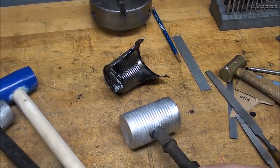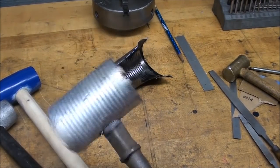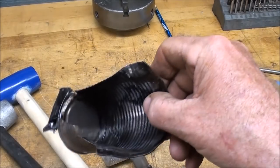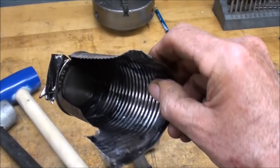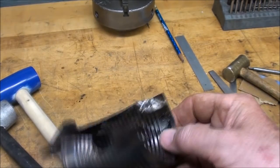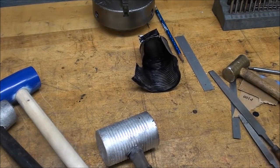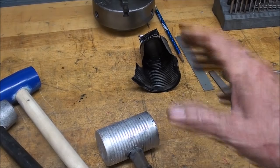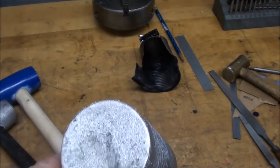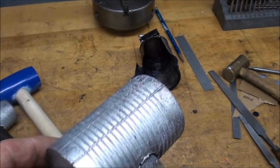Perfection at last. I poured that one off camera, because everything about this one was the same as the other, except that I torched all of the plastic from the inside of this can. Now, I should have known that, because that's a lesson I learned in 1967 when I started teaching, that we had to smoke all those cans first. Smoke, I mean, with a torch and burn the plastic off. So this one now, the tomato can one, it's a 5-pounder, ready to go.